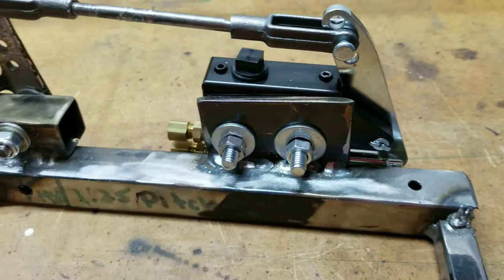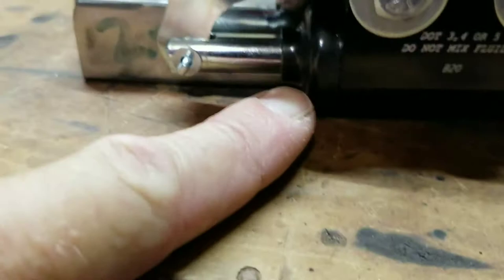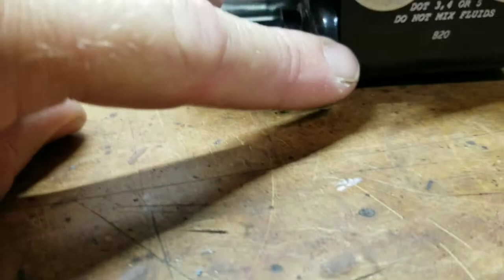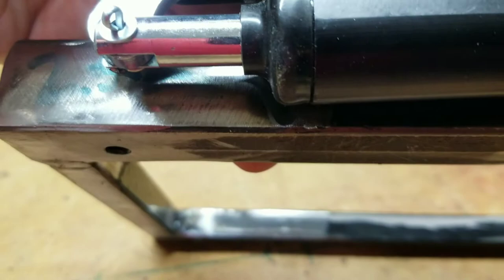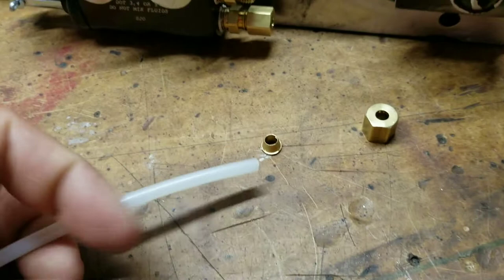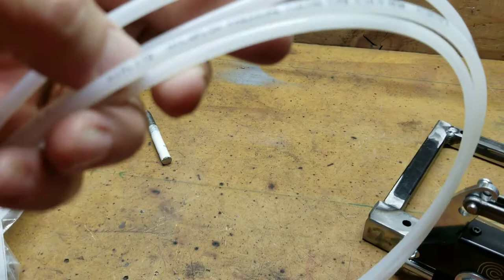There's a rubber bellows here and it sticks out a little bit past the aluminum frame, so you have to clearance the backside of the frame. I just took a grinder and ground that out. You have to mount this up a little bit so that this clears the bottom — it won't hit the floor as it goes in and out. That's just a dust cover, I think. For your lines, these little things unscrew and there's a little brass fitting in there. You use the plastic line that comes with the kit. This goes into this hole, and then you screw that into there and it clamps it in place. You need an extra 8 feet of this material — this is Air Light Nyloflow Pressure Tubing, Type 3/16ths.